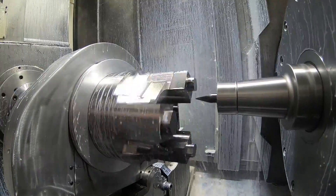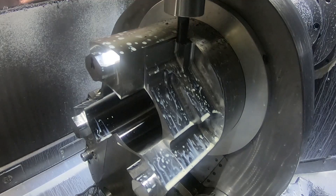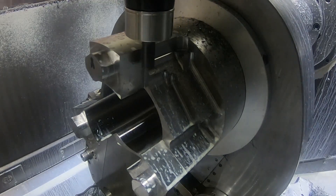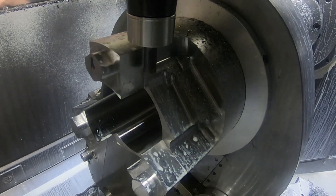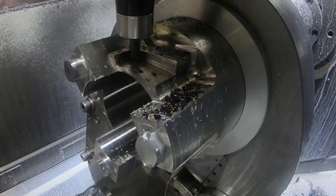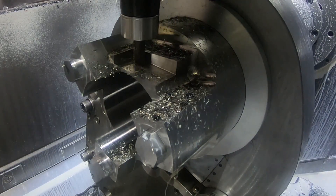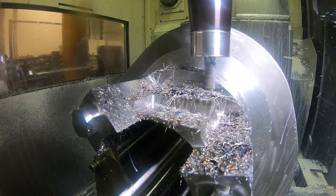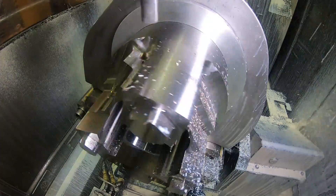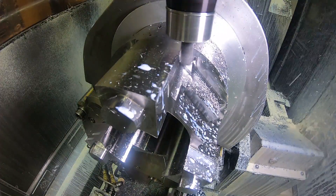Here I'm just cutting some chamfers on the pins so they'll slide into the part easier. Now machining back behind here — this is going to be a lot clearer in the next videos. Where I'm machining right now is not critical; it's just clearance for tools. But where it's machining there, there are going to be some wedges that fit underneath an overhang of the part to support it. Because the parts might vary slightly in dimension I want to be able to get that up snug so we don't have vibration. I'm also going to put a screw through there later in the operation to hold the parts before I split them into three parts so they don't pivot on those pins.